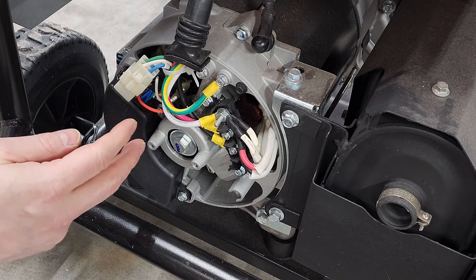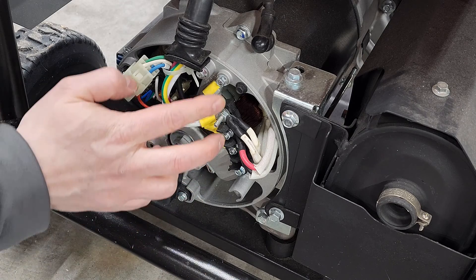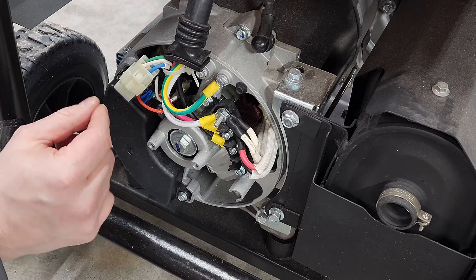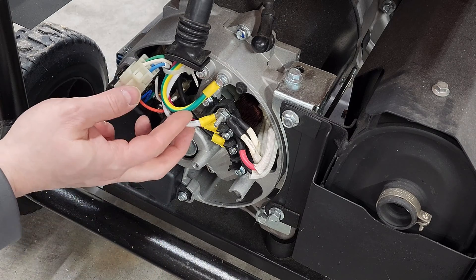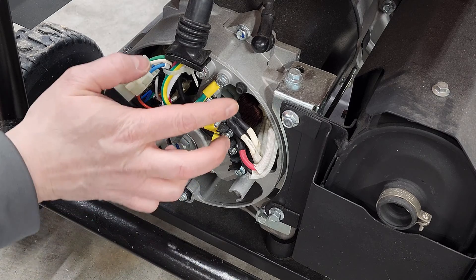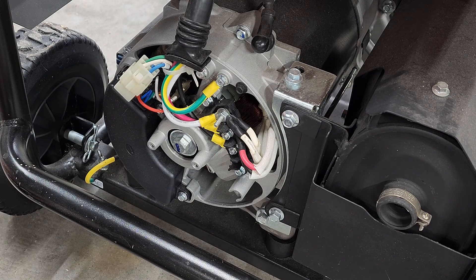If I want to switch and toggle between floating and bonded, I just have to connect these two. So I'd like to add this toggle switch so I can flip it — either open the circuit so these are floating and I can tie it to my house as normal, or close it and these two are connected so I can use it in a standalone configuration. Let's figure out what that's going to look like.